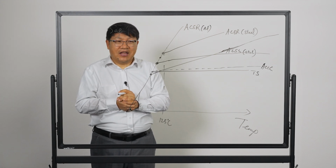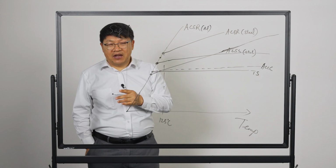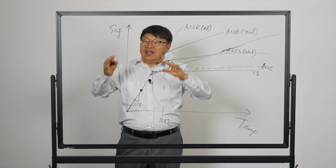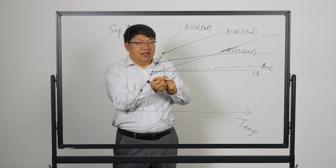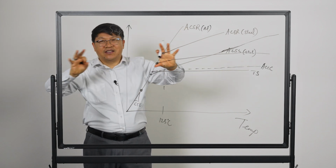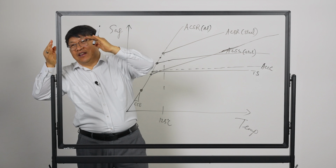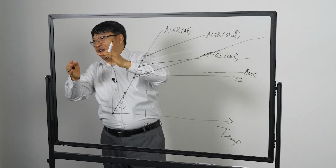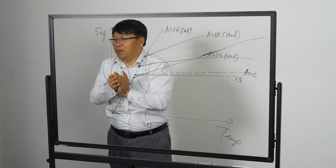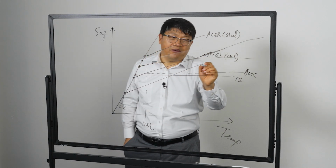We did talk about some of the other conductors, including, for example, the gap conductor. And by the way, for the gap conductor, the knee point is much lower, because the way they do it is, in the installation phase, they only tension the steel. And then a couple of days later, when the aluminum is all relaxed, they fix the aluminum. So the aluminum has zero tension at the installation temperature. So their knee point is actually the installation temperature. After the knee point, they will follow the steel slope. So they will go up like that.